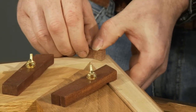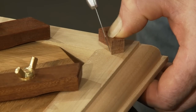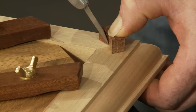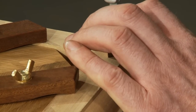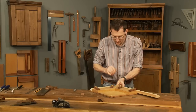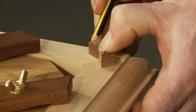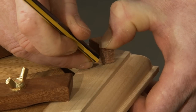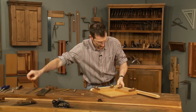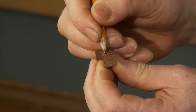What I'm going to do now is hold this little butterfly key quite firmly with my thumb and then put some quite gentle knife lines all the way around. The reason for going gently is just to make sure I haven't got any chance of moving this little chap as I mark out its position. We've talked about a bit of extra space each side, and the easiest way of doing that is to get a pencil and just use a pencil thickness on the end there to make a mark — that'll give me about a millimetre or less, which is about right. I'll mark the joint A and B on this side, and A and B on top as well, just for continuity of positioning. When I do the other side, I'll mark that differently, so I know which one goes where.